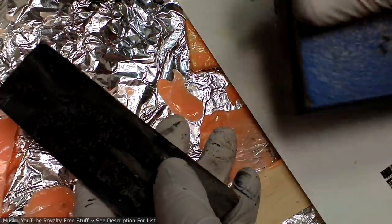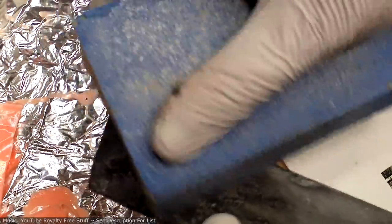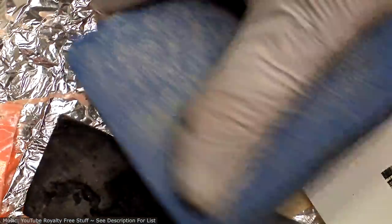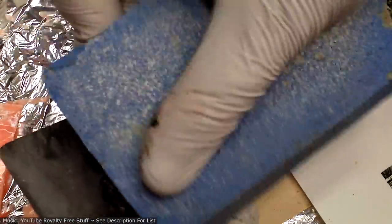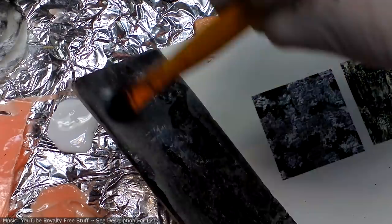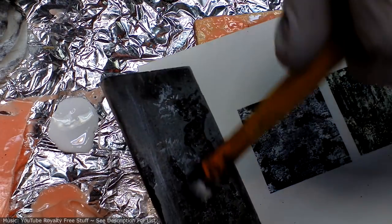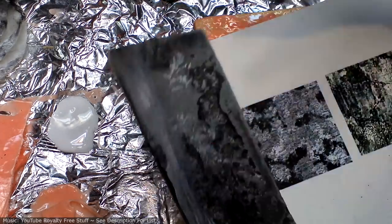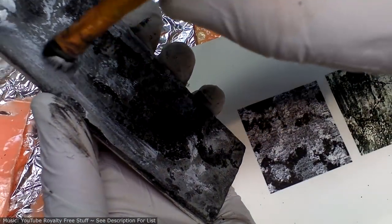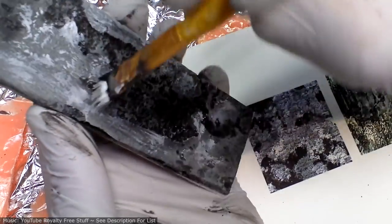Now, rather than wiping the paint off with a wet rag, I'm gonna try to just sand off the highlights. And this is where it's super nice that the material itself is tinted gray, so that I'm literally sanding down to the highlight color. Well, not the highlight color, the mid-tone color. There we go. Now let's just throw a little highlight color on and see what that looks like. Try to work in some of that streakiness that the texture has. It's got both globs and streaks. The streaks might have to be sanded in, I think. Doesn't look so great when it's hand painted on top. Looks like brush strokes.